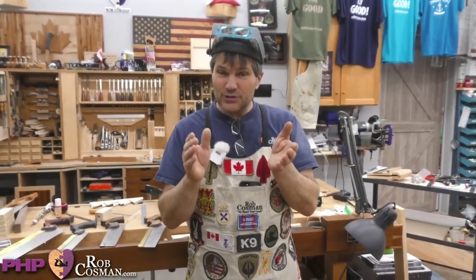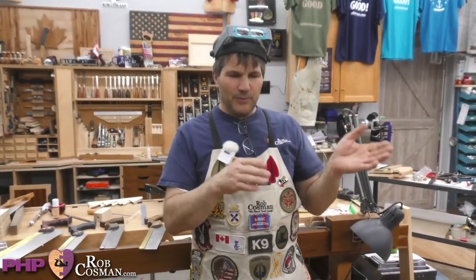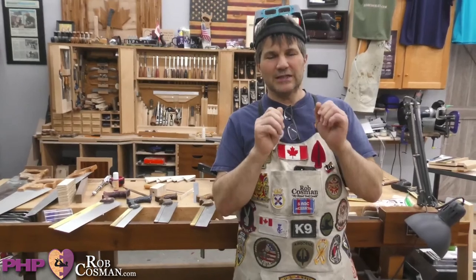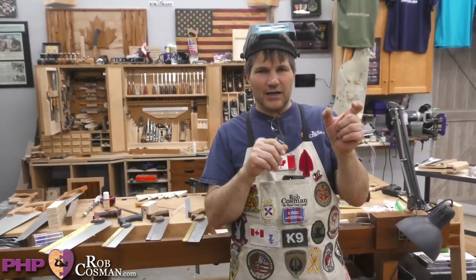Like Alan Peter said, your saw cut is the last thing you do before you put glue on the two pieces. You don't come in and pare. Maybe if you have to fix a mistake, but you don't intentionally do that. Well, we had people struggling. The saw would cut nice and fast once you got it going, but if it wasn't in the right spot, I had this idea. What if you had little tiny teeth that were really easy to start? And then you just did that at the front of the saw. The back of the saw had big fast-cutting teeth, so you weren't there all night.